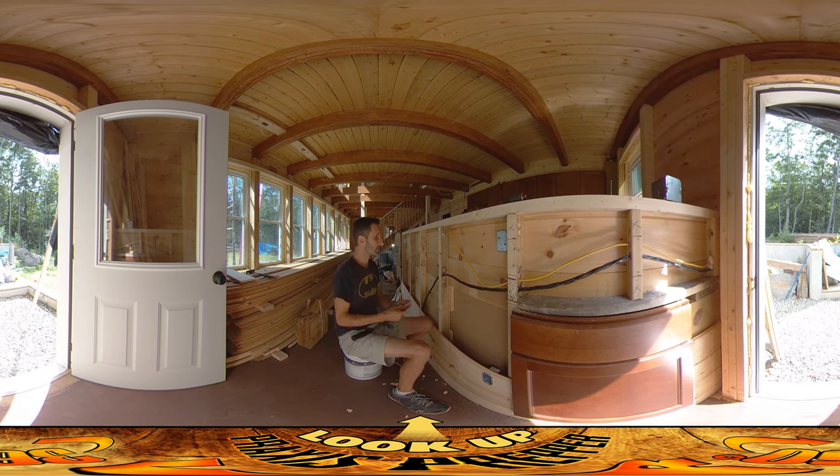In preparation for that, a lot of professional contractors will just put the plates right on and get the wall over it one way or another — and oftentimes you'll see the wall bump up or bow out a little bit. I don't want to do that, so what I'm doing is chiseling them out so there's a little recessed area for a much smoother surface.